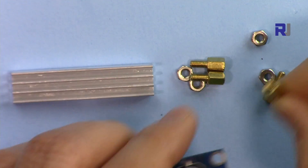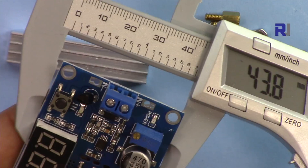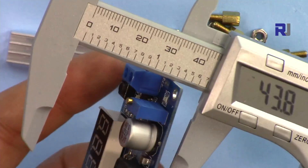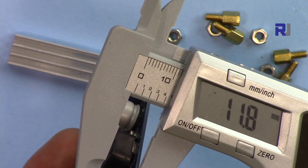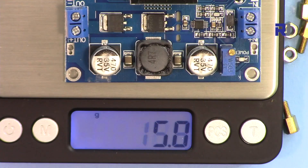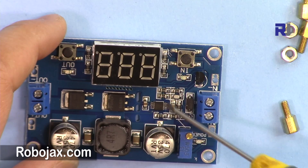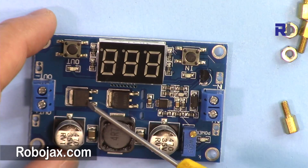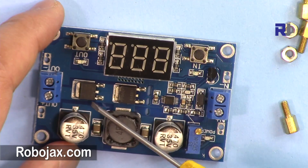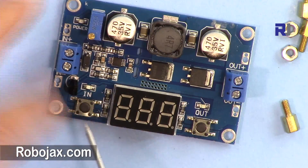The length of the device is 67.2 millimeters, the width is 43.8 millimeters, and the height is 11.8 millimeters — the biggest part being the capacitors. Without the heat sink it weighs about 20.7 grams, and with the heat sink it's 25 grams. This module has three important components: the actual voltage converter (LTC1871), a power MOSFET, and a reverse polarity protection Schottky diode.